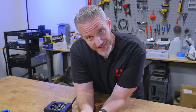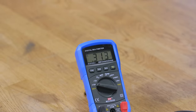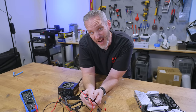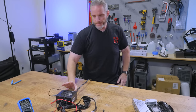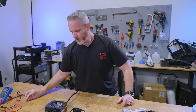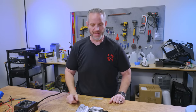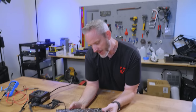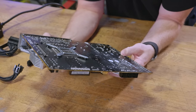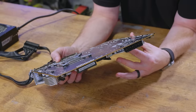You can imagine now if you jumper 12 volts to something that's only supposed to be seeing one volt with a metal backplate, how that could be a problem. So what I'm going to do is start testing different areas of the motherboard to see where we're getting 12 volts and maybe where we're not. That can at least give us an area to examine — probably what Northridge Fix would do too. It's probably going to be a voltage regulator somewhere, or a MOSFET or something like that. I'm looking for a physical short on here, like a little burn mark, but there's nothing.